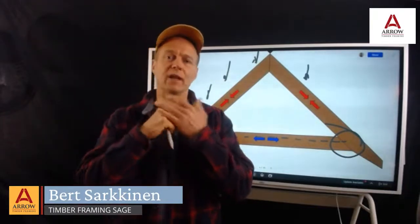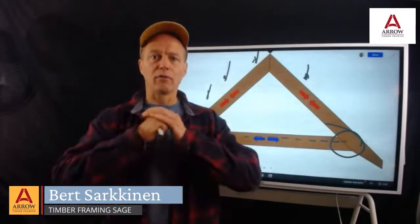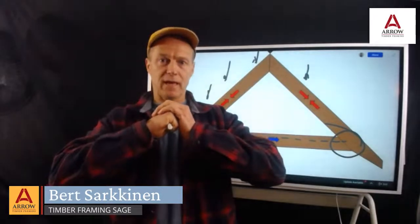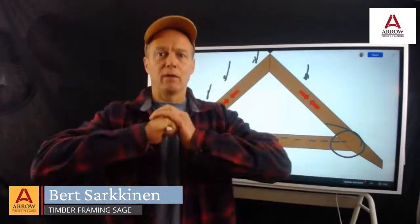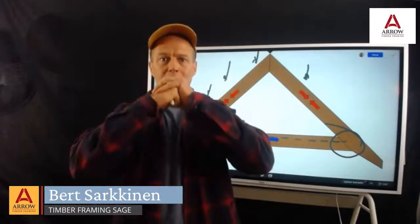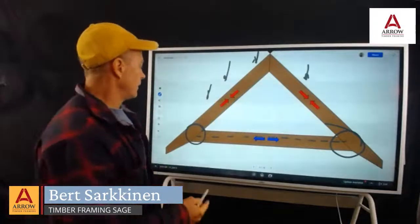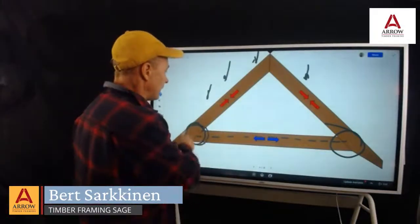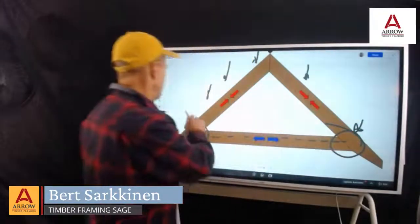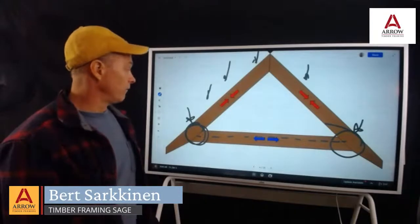And then if you go to say a Mediterranean low pitch roof, like a 3/12, 4/12 and something down here, and apply force on your fists again, it'll pancake really fast because the thrust just magnifies the lower that gets. And so that's what these connections are all about, that tension. The very most important connection in a truss happens right here.